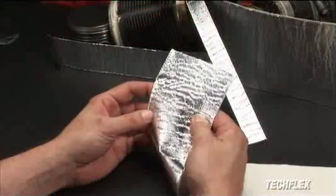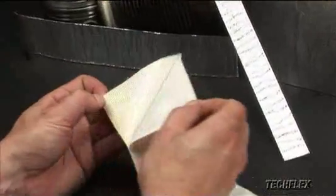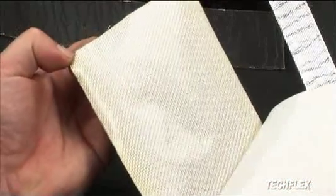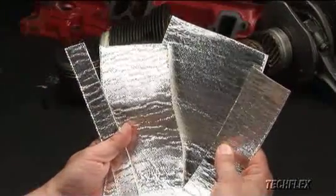For other applications, ThermoShield Flap provides the ultimate in customization. The flat sheet is fully backed with high-temperature adhesive. Custom shapes may be die cut or cut with ordinary scissors and applied to flat or contoured surfaces. ThermoShield Flap is available in sheet widths from one to eight inches.